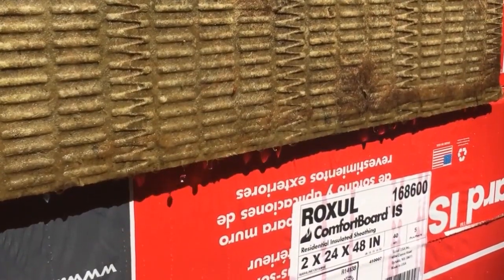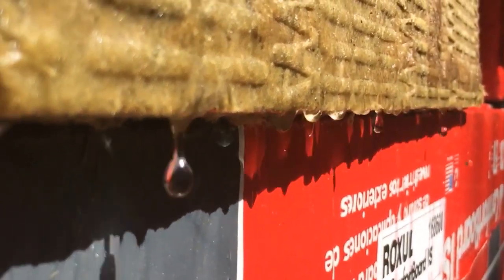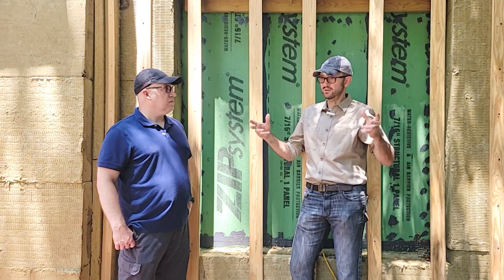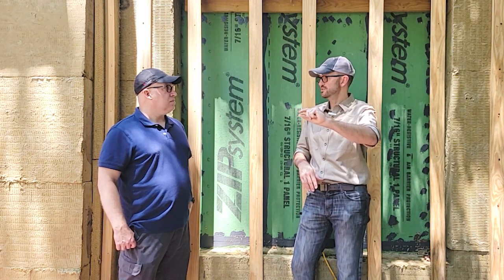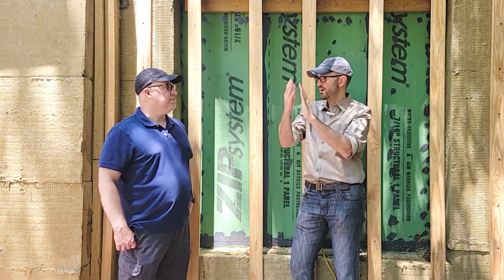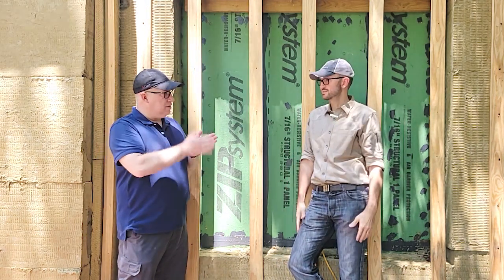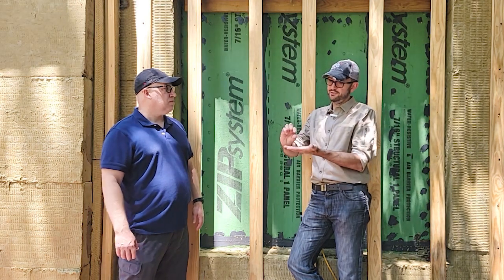Here's a link to a video of a two-inch stone wool slab we put on one of our projects that stayed out on the floor deck overnight. It was a deluge in Florida — tons of rain. The piece was flat and it filled only the top three-eighths to a half inch with water and didn't go past that. I lifted it up and within 30 minutes it was completely dry — all that water gone. We did notice water likes to go through the product one way and not the other, which is good — that's how it's installed.